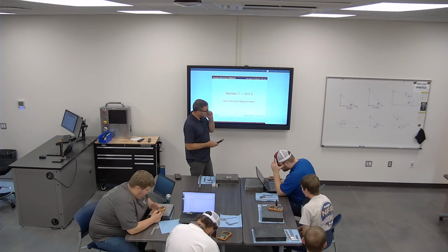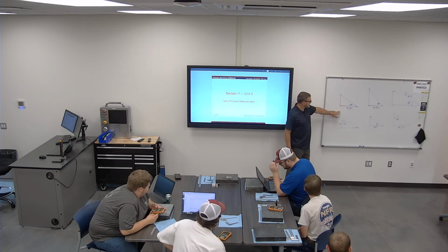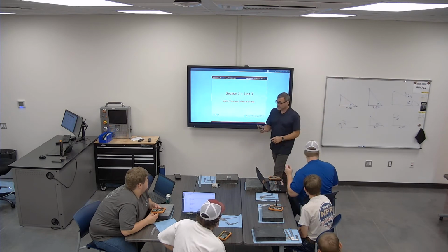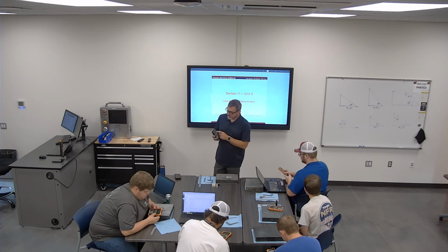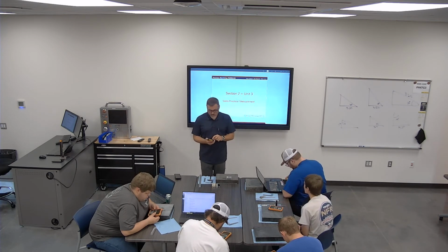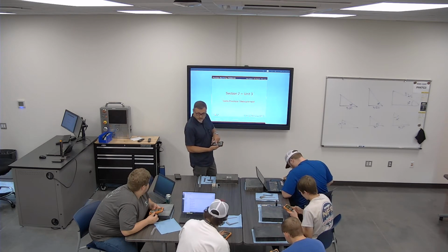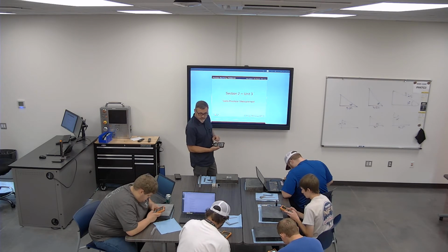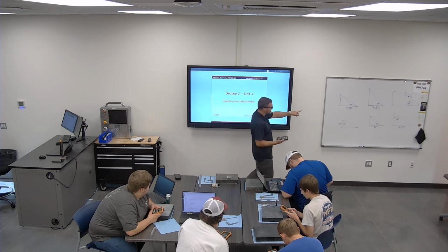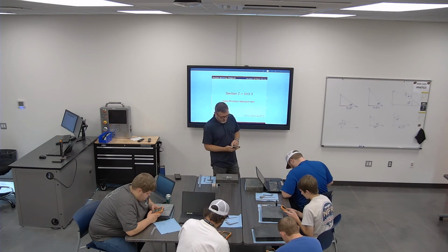Okay, I've got this one here. I know what the length is and the angle. So I go to my calculator, hit on and clear a couple times. I think two times clears everything. Then I put in 30 for the angle. The side adjacent to it, what's next door to it, is 5.25. So type in 5.25 adjacent.